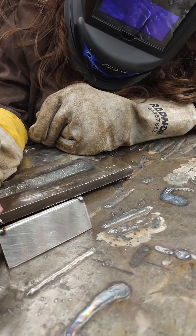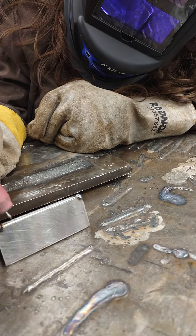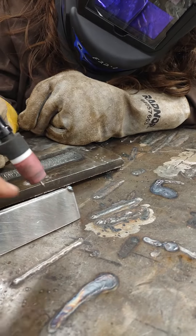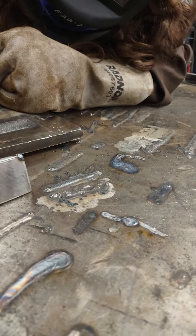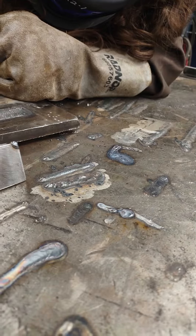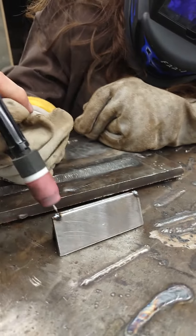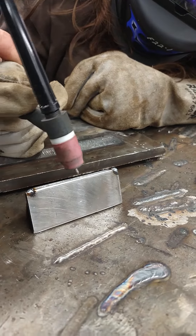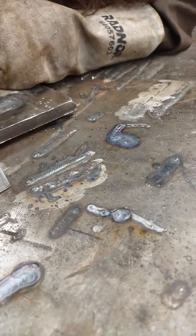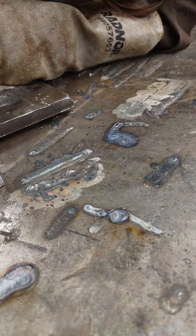Point the tungsten slightly forward. If it feels uncomfortable at the end, slide your hand down farther. Your hand is kind of tilted over a little bit — let's get it closer to straight up. Do it a couple of times like that, and then we're going to turn the fire on. Get a little closer, and get into position like you would be if you're welding, which is going to be down here like that.